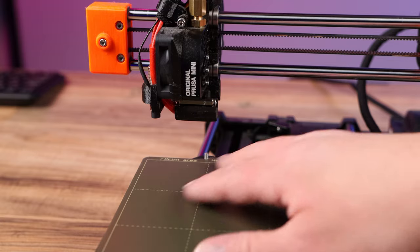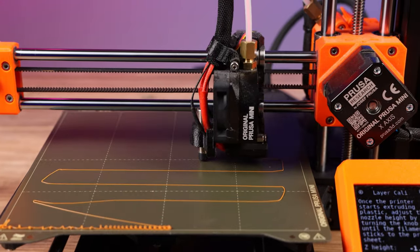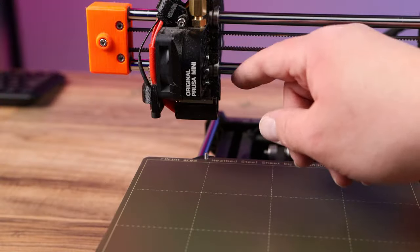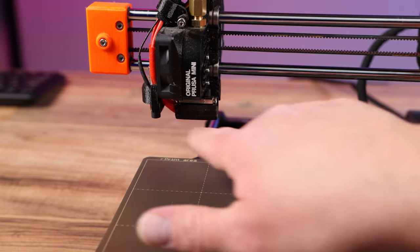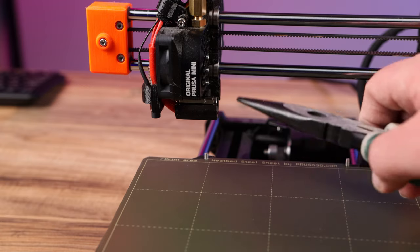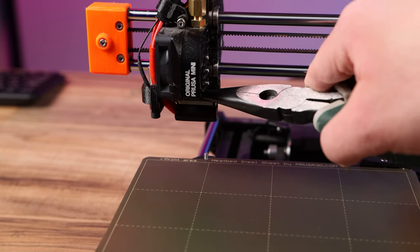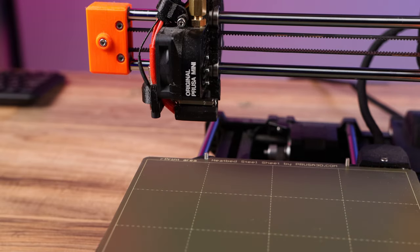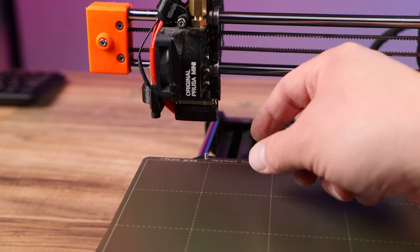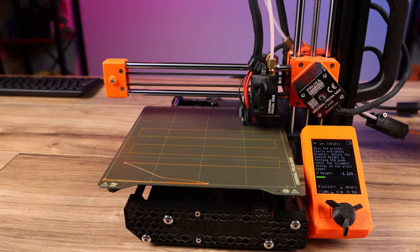I just want to jump in — when I was doing the calibration I noticed I couldn't get low enough for the filament to hit the bed. That's because my new Copperhead was pushed too far up. I needed to pull it down a little bit and make sure it's lower than the Super Pinda probe. I carefully loosened the three screws on the side, pulled it down a bit, then tightened them back up and tried again.